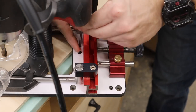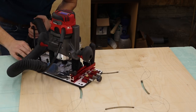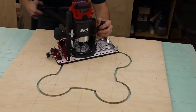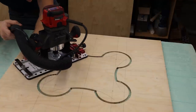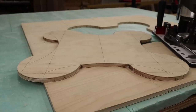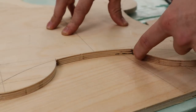With the four larger arcs done, I moved on to cutting the four smaller ones. But before I could start routing, I had to adjust my trammel pin so I could create a smaller arc. Then once I was set up, I just followed the circle around until it connected with the other arc. Now you may be thinking: why not just use a band saw and sand the line? Well, it's not going to come out nearly as perfect. Your transitions from arc to arc will be sloppier and the four sides won't be symmetrical. With the multifunction router base, the edges come out smooth and dead-on accurate — there is no wasted time spent sanding to the line and trying to correct imperfections created by a bandsaw.